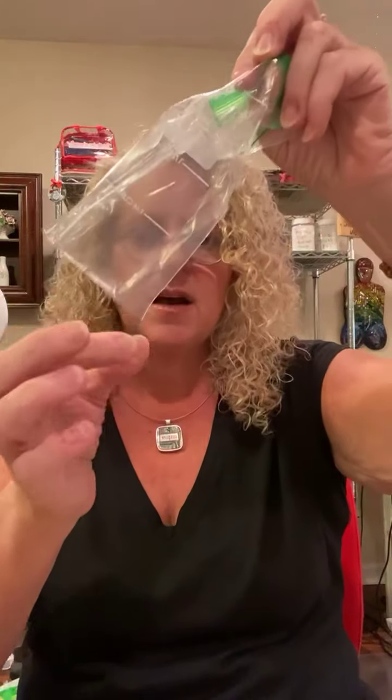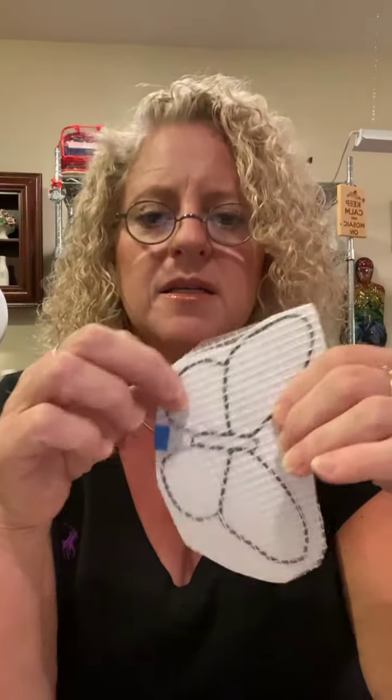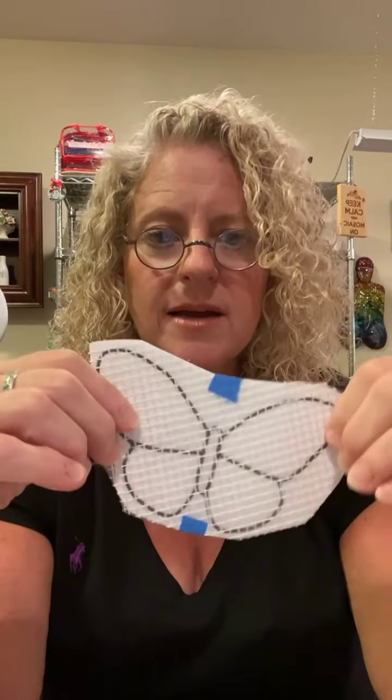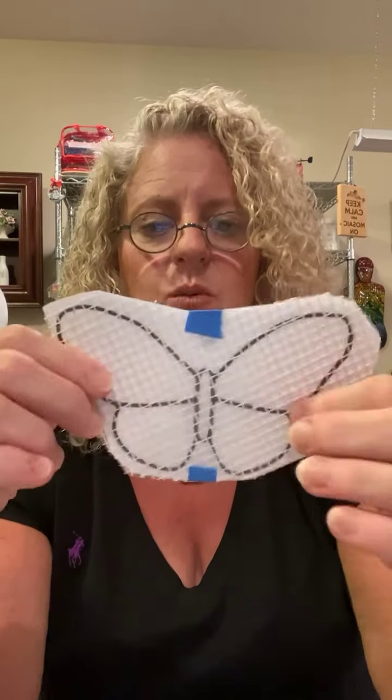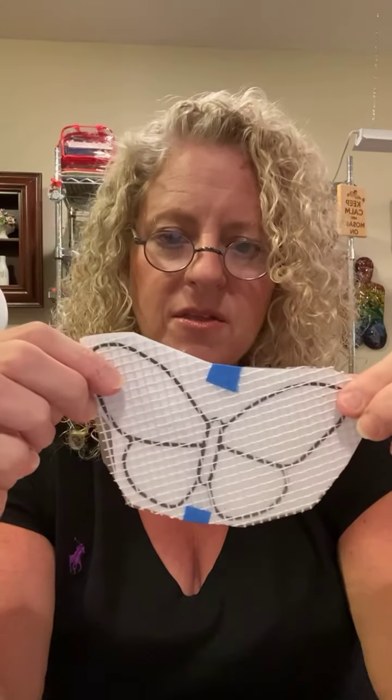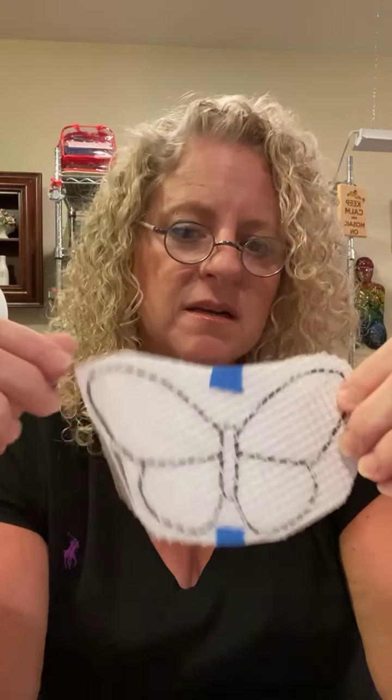it up, and then I cut the little corner right there, and that gives me the ability to take my thin set here and squish it kind of like an icing bag. And since I'm using the Laticrete Platinum 254 thin set, I know it's exterior grade, I know it's great quality, it'll stick with the thin set that she's using, so I'm actually going to cover the tiles completely with the thin set. So when this is done and dry, it's going to be really hard because you've got a layer of thin set underneath it. So that's it.